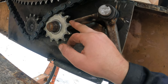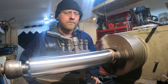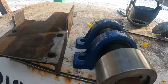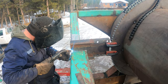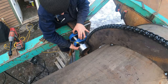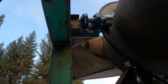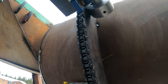Here's the tensioner system I whipped up — this is a number 80 sprocket with the pivot right there and a trampoline spring going back to the frame. With the sprocket sitting in place, we'll whip up a thrust wheel also. We have the thrust assembly all put together. This wheel I use on all my trommels and they seem to last about four or five years. We'll get the bracket in place and tack it in. I will be adding extra gusseting as these have a tendency to flex and break off. What a thrust wheel does is prevent the barrel from sliding down — when the barrel is on an angle, gravity naturally wants to take it downhill. The drive assembly and thrust system are all done.